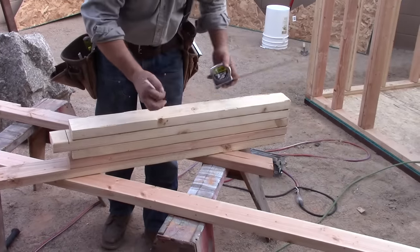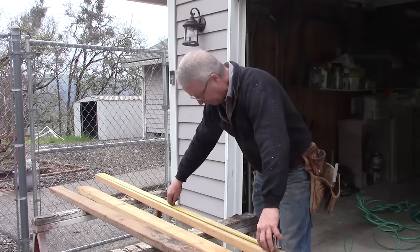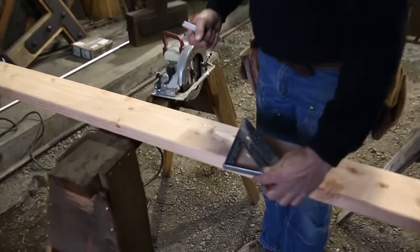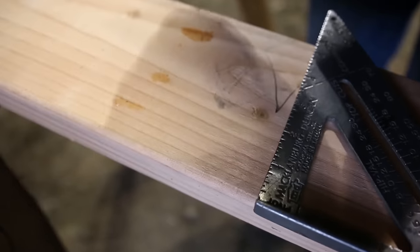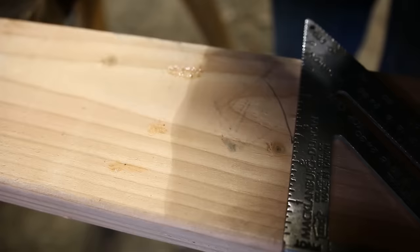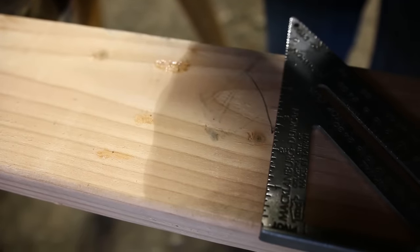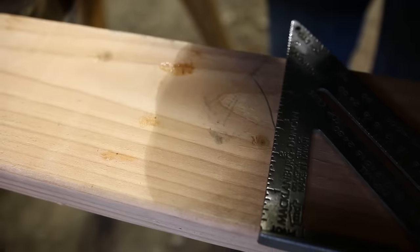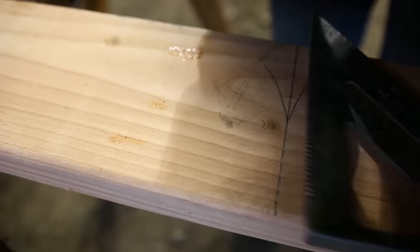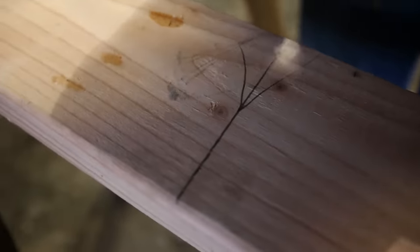That does a couple of things, but primarily it makes a mark that's big enough to stand up to the pressure of construction. Maybe a dirty board. Now it's time to square it. You can see the near leg disappearing as you get to the mark, so you can keep track of the intersection. You see that? If it was just one mark, you would not be sure where the apex was until you were past it. Perhaps that's overthinking, but that's just a good, fast way to make a line.